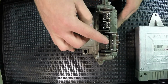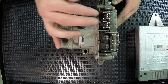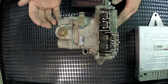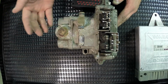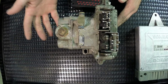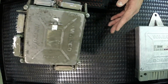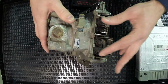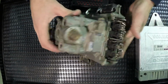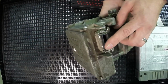On the side here, we can see our connections to our wheel speed sensors for our ability to connect up to 4 sensors. So we'd be able to create a 4S 2M system with the modulator valve in, our wheel speed sensors, and our external port being mounted on the side right here.